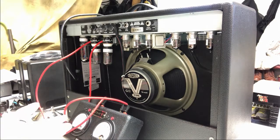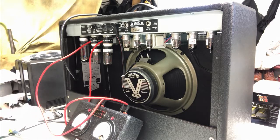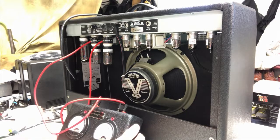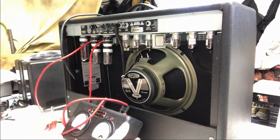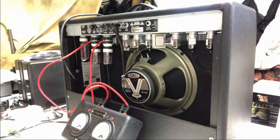So I'm gonna stop the video now for a while, guys. This is gonna sit here. I'm gonna leave the meter on. I'm gonna let this thing sit for about a half an hour, just like this, with the new tubes in place, and leave my bias meter sitting in line here as well, so that I can come back and check in a half an hour, make sure everything is as it should be.